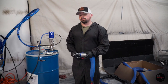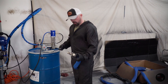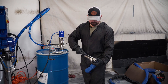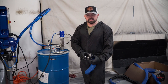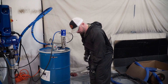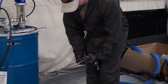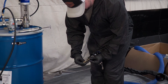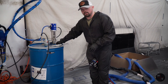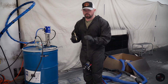We're done spraying. Time to go ahead and shut down the gun. First off, make sure your safety's on — in and to the right. Safety's on. Now we can go ahead and close our valves. Close the A valve, close the B valve. Again, don't bear down on anything — you don't want to snap that little nylon washer that's in there; we don't want to crack that and start things leaking. Now let's go ahead and drill the gun. I like to put the gun between my legs so it's nice and secure, so I don't snap one of the drill bits while trying to drill it out. One hand guiding and one hand drilling. If you meet a lot of resistance, don't try to just power through it — you can snap these bits off and it's very hard to get them out of the mixing chamber. If you meet resistance, do a little bit at a time and work your way through it.